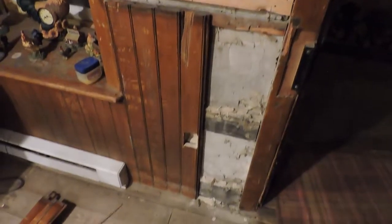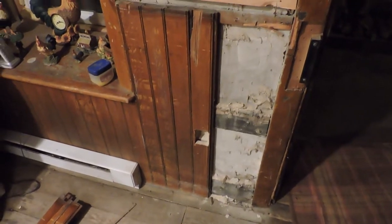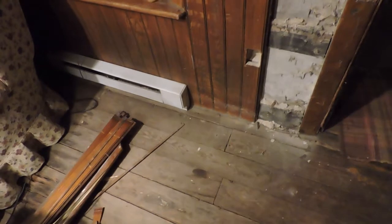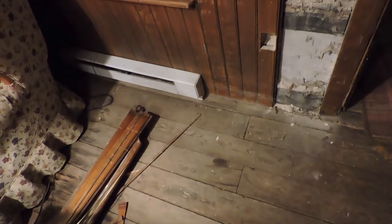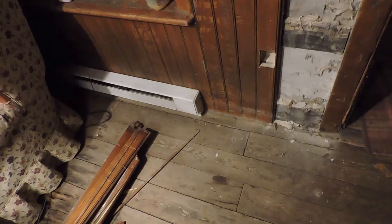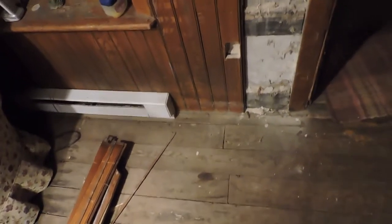And also here in the living room itself, it was never updated the way it should have been. There was electric heat put in here in the 1960s. I've since upgraded that. Probably 20 years ago I put better baseboards in, but I hadn't redone the wiring, so I need to change that. Also, there weren't many receptacles in here, and of course we want to change that.